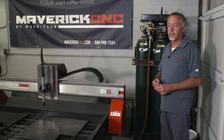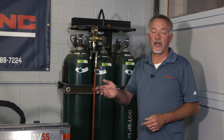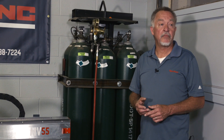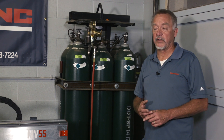There are a few different ways you can do it, but the real key for the best performance with a plasma is to have what we call clean, dry, compressed air delivered to the plasma. This particular one uses about 6.5 CFM — cubic feet per minute — of air at somewhere between 90 and 135 PSI. That's the pressure that the air is delivered at.